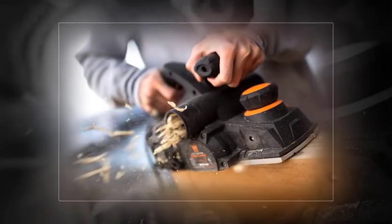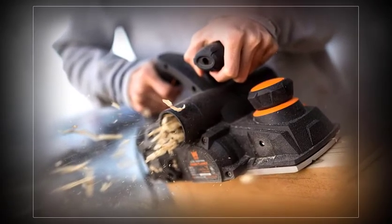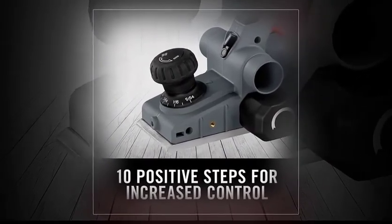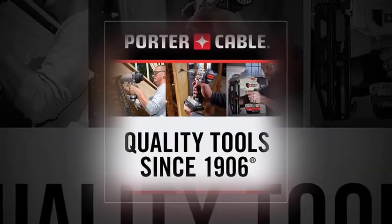Here are simple steps that will get you started with using an electric hand planer on wide boards. Step 1. Flatten big slabs of wood. Do this in several steps to give the best result. Place the monster board on a flat surface and make it steady with shims.